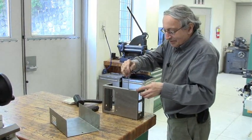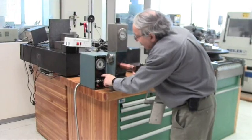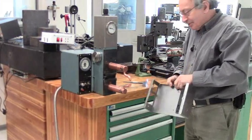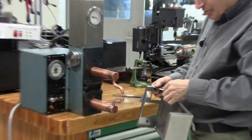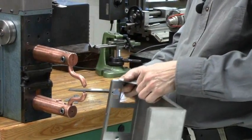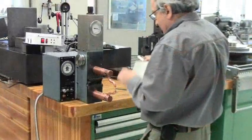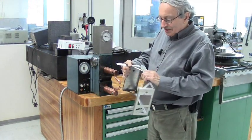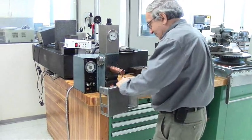Another thing you always do with sheet metal: you never make the cover reach out to the end because you get a sharp edge. You always recess the cover a couple of millimeters so you get the rounded edge of the bend — no sharp edge. The problem with a sharp edge is not only cutting yourself — the paint will always chip from a sharp edge, so it will look ugly. You always recess it so if you hit something, it hits on the rounded corner. Now we know the cover is good. We bend the cover again — left hand and right hand — and now the cover fits.